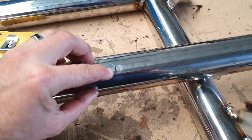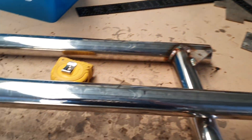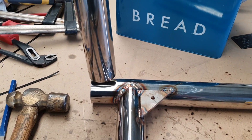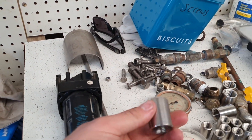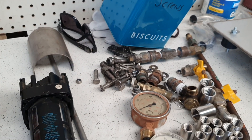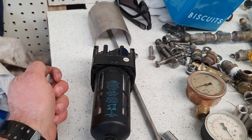Next thing I'm onto: see the mark on my bit of pipe - I'll cut him off, put my coper back in the vise, and then fit this piece to there, and weld a half-inch BSP bung to the top of him for the water trap. So let's get into it.